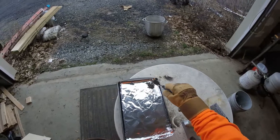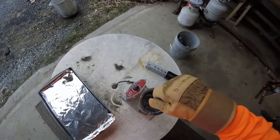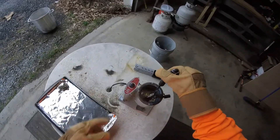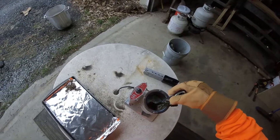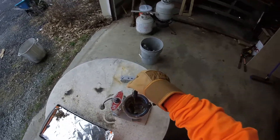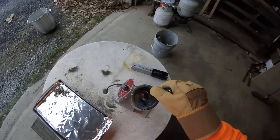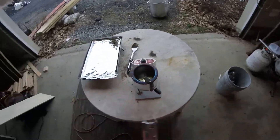You can see some oil in that. We're getting a lot of slag — we don't want a lot of that in there because it'll clog the pour hole. It's hard with this giant glove on, just gonna weasel it around. This stuff is boiling hot. You know me — I'm too impatient. I think I'm ready to pour some.